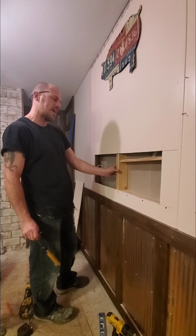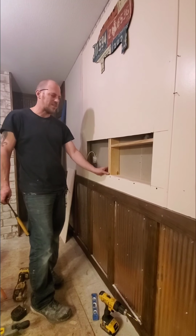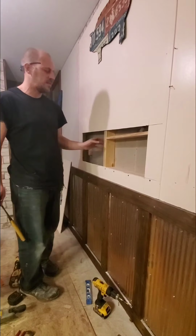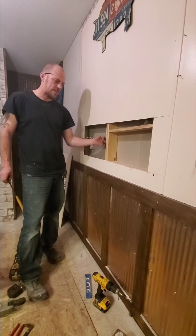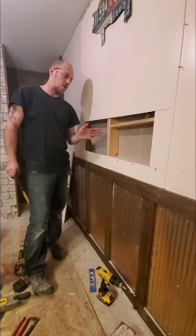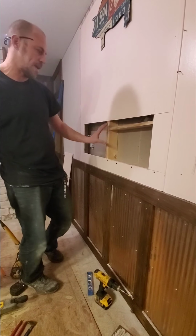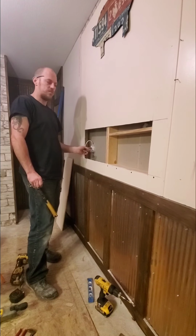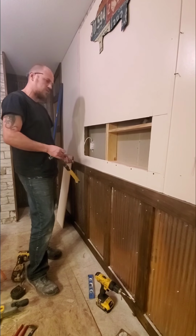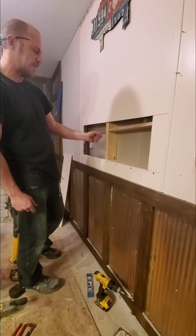Because we are in a prefabbed home and everything is set on 2-foot centers, we don't really want to take this guy out of the equation. It's not a load-bearing wall, but we just really don't want to take him out. The way a lot of these homes are put together, there's 500 staples on the other side of this 2x4. And we really don't want to get into the other side of the wall with doing all that. So we're going to keep this guy in play, and we're going to make 2 separate boxes instead. Electric is another reason why we have a problem. So no big deal. We're just going to make the 2 separate boxes. And if you want to make the whole stretch, again, you would just cut this guy out of the equation.